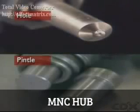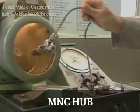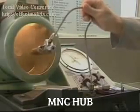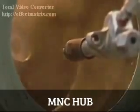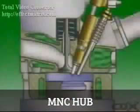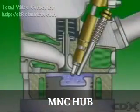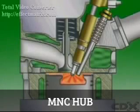There are two main types of injector nozzle: hole and pintle. Hole type nozzles are commonly used in direct injection engines. They can be single-hole or multi-hole and they operate at very high pressures, up to 200 atmospheres. They give a hard spray which is necessary to penetrate the highly compressed air, with high velocity and good atomization desirable in open combustion chamber engines.